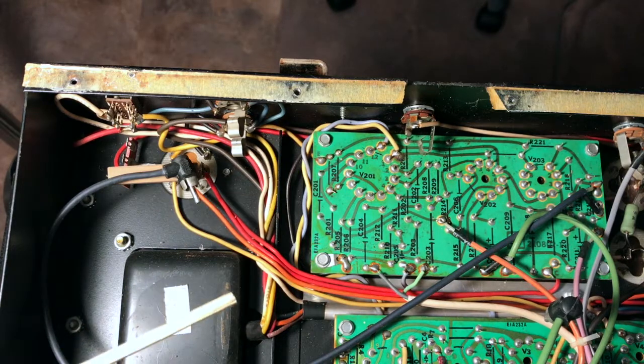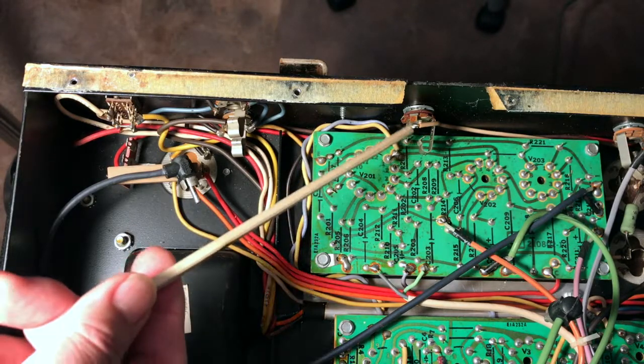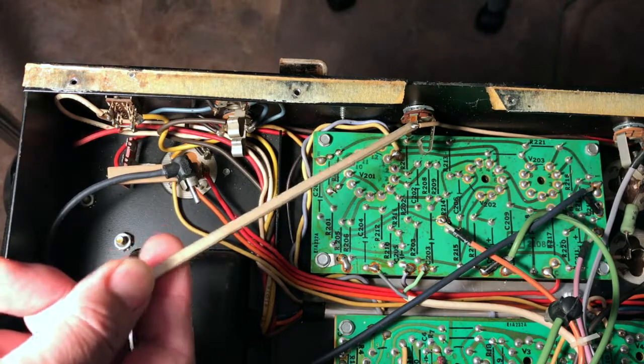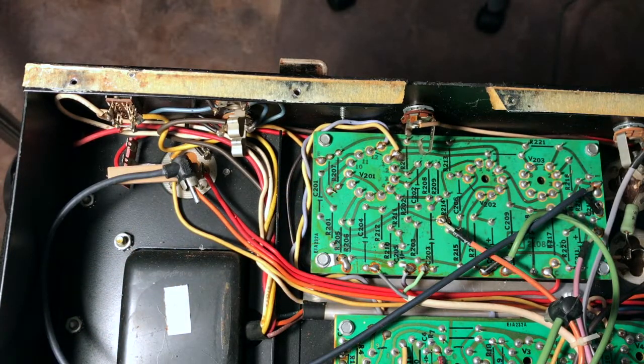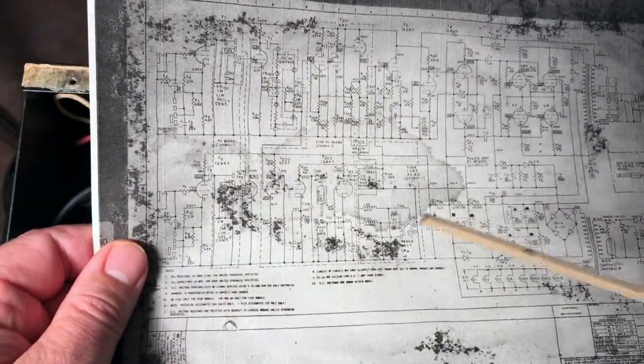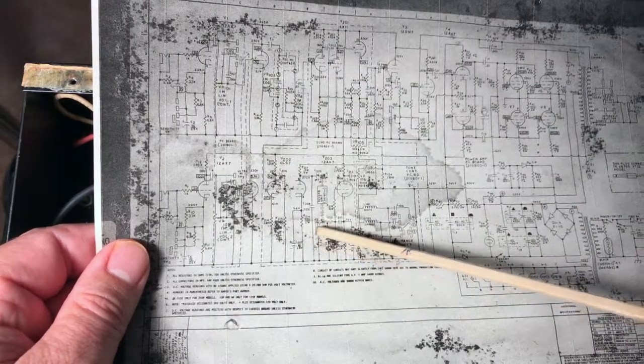So what we have here is potentially a ground loop. This jack is connected to ground at two different points. Well, first of all, there shouldn't be too much current going through that jack. I don't know. Let's take a look. How does that jack function? I don't know if it can be shown here. That foot switch jack is here.